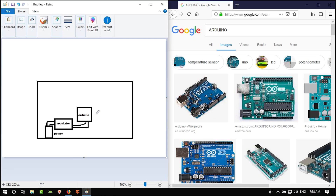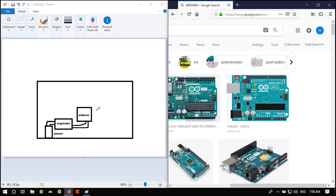We have our Arduino — the microcontroller with bypass capacitors, reset circuit, and everything it needs — plus a regulator and DC jack. Now we need a USB-to-UART converter. If we have a large project for mass production we don't need to add this component, because we only need to program the device once.